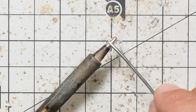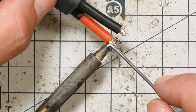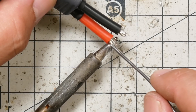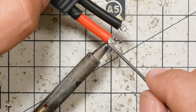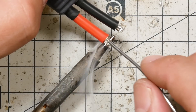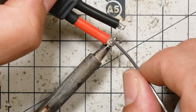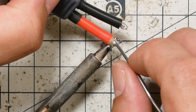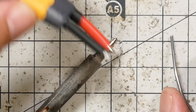If you're just touching the solder to the tip, of course the solder is going to melt, but that's not actually getting the solder into the wire, which is what you really want. A little bit of wet solder, and just wait — I'm touching the solder to the wire, waiting for it to start soaking in. There we go. The wire got hot and it takes the solder in. So now the wire is nice and tinned.